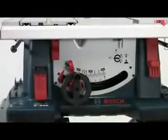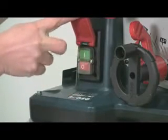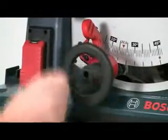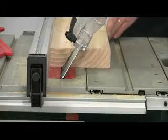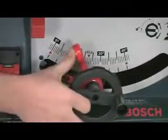All the controls are on the front of the saw with the on/off switch being large and accessible. The flip down front protects against accidental starting but it means you can still switch off easily even with your knee if your hands are full. Another good safety feature is the internal brake which brings the motor to a halt very quickly when you switch off. The rise and fall hand wheel for the blade operates smoothly and allows you to quickly set the required cutting depth, or drop the blade below the table for safe transport. For bevel cuts you can tilt the blade up to 47 degrees to the left and even 1 degree to the right, and it locks positively at the required angle with this lever here.